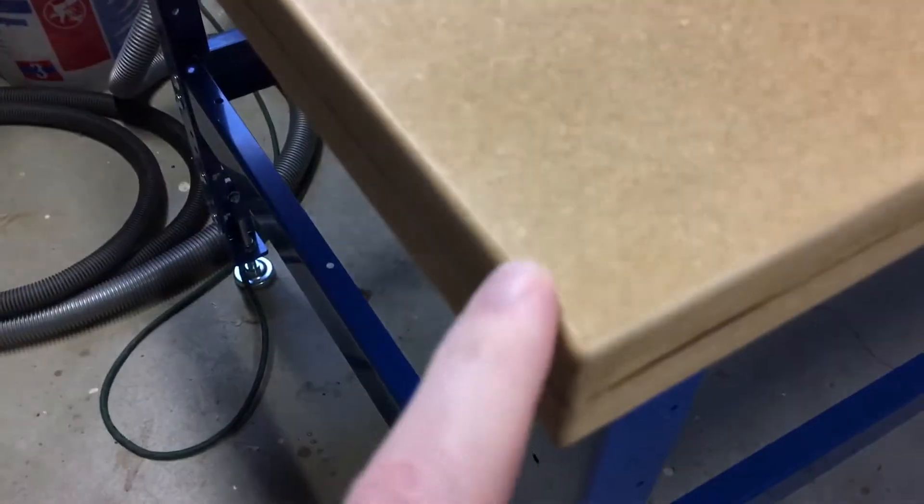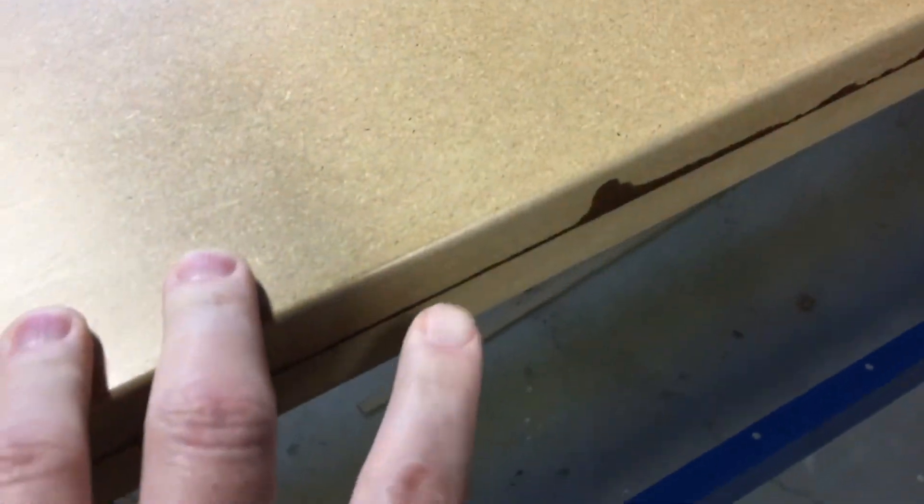I have two coats of finish on here and it has kind of a rough texture. I could have sanded after the first one but figured I'd just put a second down. Here's a close-up of the corner — you can see a little epoxy squeeze-out here and there. It doesn't look pretty but it won't bother me. There was also a drip that got on the top. I'll probably find the best-looking part of the desk for videos. I don't know if I'm going to finish the other side — maybe just one coat to seal it. Now I'm going to sand this — I have a random orbit sander, a pad sander, and foam sanding blocks. I want to smooth this down and give it at least one more coat.